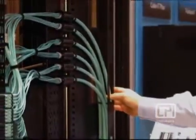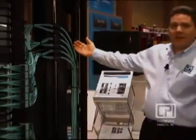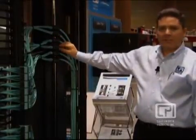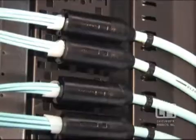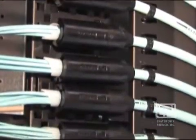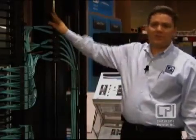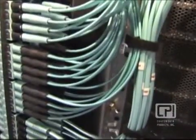The trunk cable manager houses the trunk cabling routed up into the cabinet, but as it arcs over into the horizontal, we've provided points for strain relief to hold the trunk cable secure just before the trunk reaches the furcation plugs. At this point, the furcation plugs are anchored to the vertical furcation bracket, arranging them so that the fibers can easily and gracefully be routed to the back of the Zero-U connectivity.